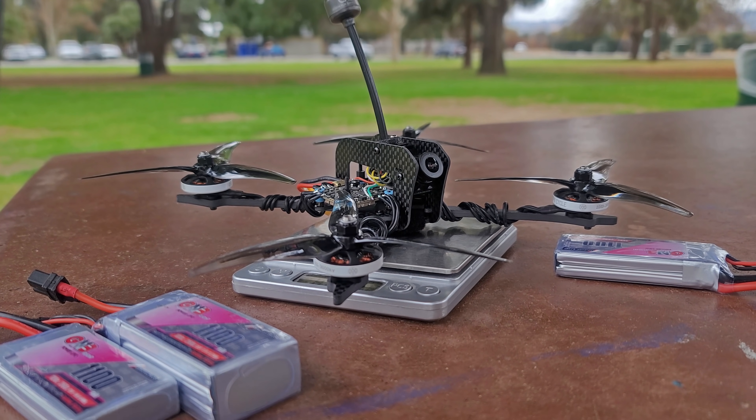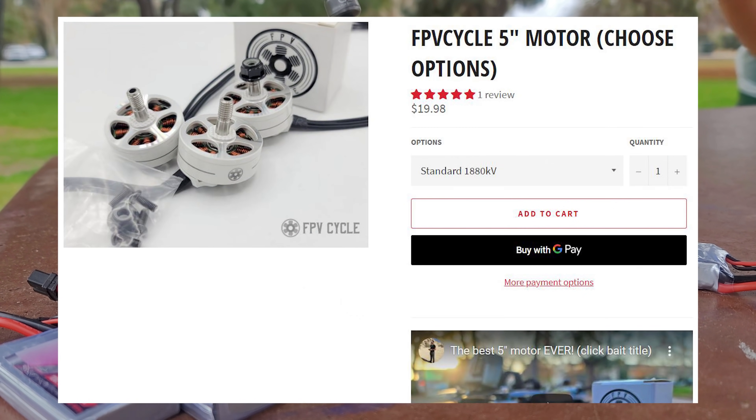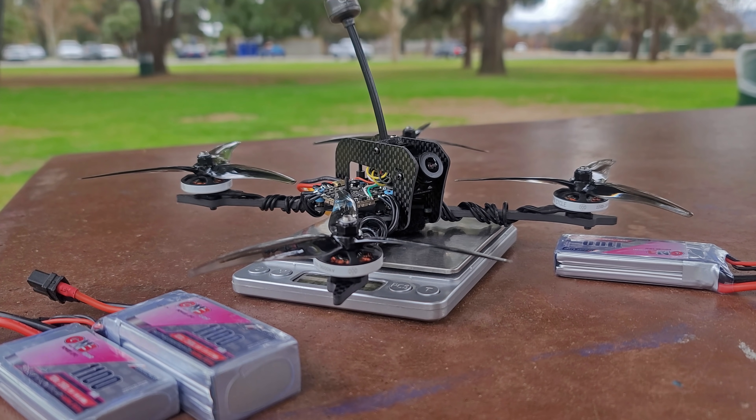I think it's because the stator has enough voltage to saturate itself with current. I'm mixing a bunch of concepts there, but this is the intuition I've gained from testing so many motors. The dilemma with motors larger than 2306 on five-inch is that on 4S, regardless of the KV you give the motor, it just didn't seem to have the same bite, power, response, or performance that a smaller motor would have. If you were to move this to a 2004 motor, it would also be more responsive — not just because of stator voltage saturation, but more so because you have more magnet height, which gives the motor more magnet to pull and push against.